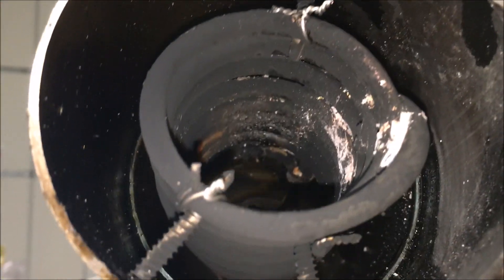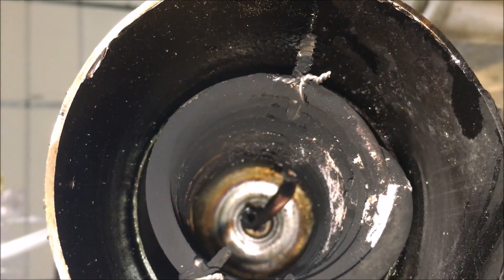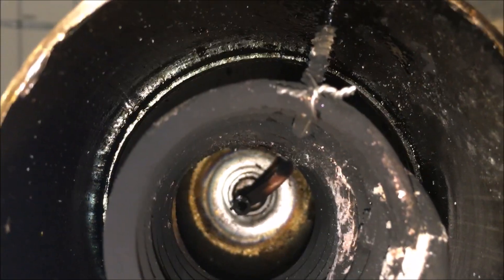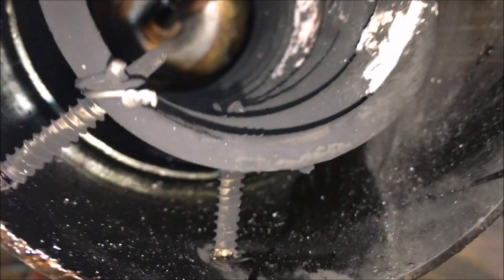What we have here is a vaporization coil for a waste oil burner. I did a preliminary test with the combustion chamber open to observe the effectiveness of the coil and to make it easy to light initially. I had a spray nozzle connected to the end but it blew off almost instantly. I was under the flawed impression that some good antimony solder would withstand the temperatures in there, seeing as how it had cool oil flowing through it. I was wrong. I'm not sure what that white stuff is — it may be flux. You can see there's a lot of gunk and buildup from just the very small test run.